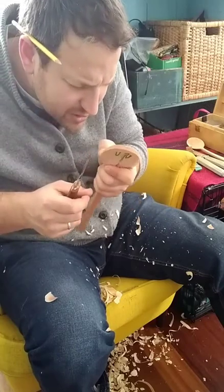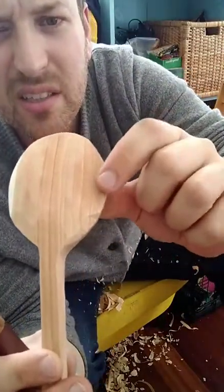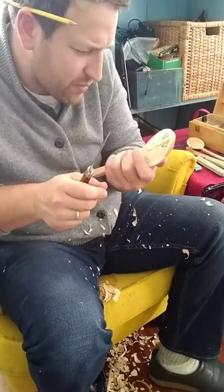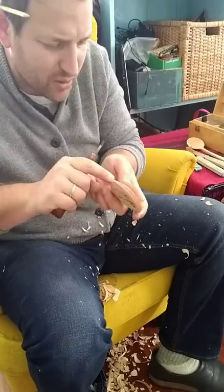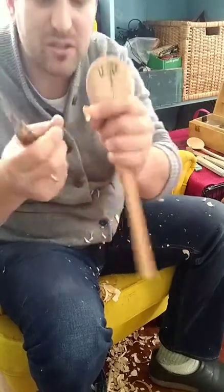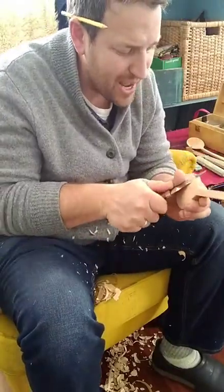One thing happening back here — you see those two streaks right there? Those are some hairline cracks. It's really unclear how far they go in. I don't think it's very far because I'm not seeing evidence of them further along and they don't go all the way out to the rim. Let's see — yeah, it's definitely a fracture; you can see it in the chip itself, you can see it's bent. So all of a sudden this becomes the limiting factor and I have to carve that away until it's gone.